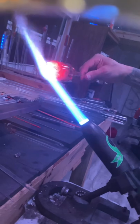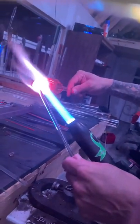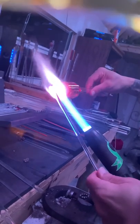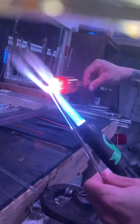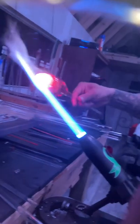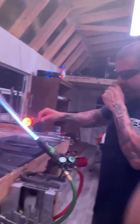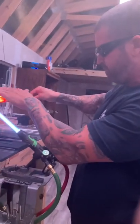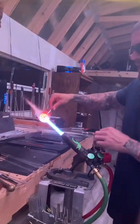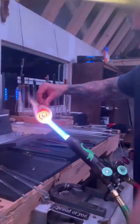I use a five mil piece of glass to seal up the end and get any extra glass that would be on the outside. Now everything on the inside is nice and enclosed. I take out my earplugs, give it a quick blow — just trying to even it out so it's the same diameter as the rest of the glass. I'm not trying to blow it out, just want it to be even.